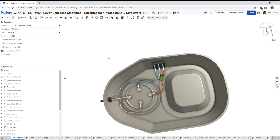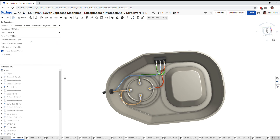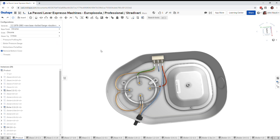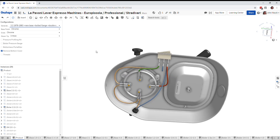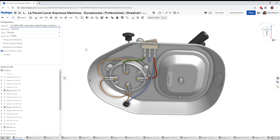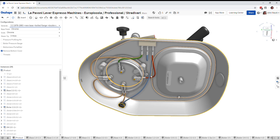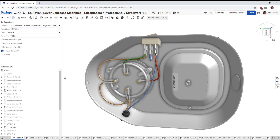Green or red gives you 300 watts or 700 watts. They also introduced a new double switch, and the boiler bottom is now a three-bolt boiler bottom — no longer just screwed in like the previous generations. The brown wire goes to the two heating elements inside, green going to the 300-watt and red going to the 700-watt.